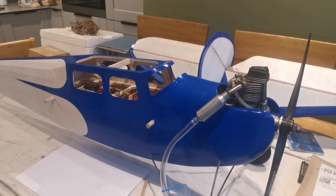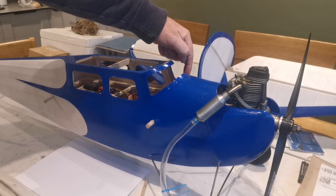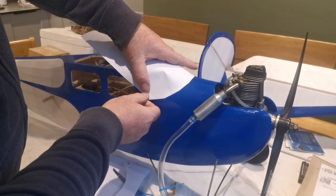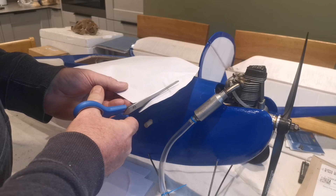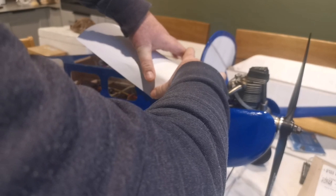I like to tackle the more difficult things first, otherwise I always find them a mental block to making progress. And obviously the most difficult part to glaze is going to be this curved area here. The glazing is going on the inside, not on the outside, and I think it's going to produce a very neat finish. But I need to find this shape to match the inside. I'm going to do that by making a paper template — just hacking out roughly a curve very roughly. I think I need to take a little bit more off than that. That's roughly the shape.